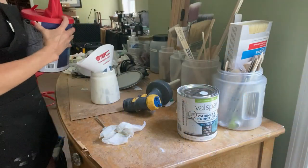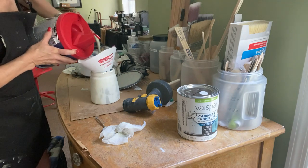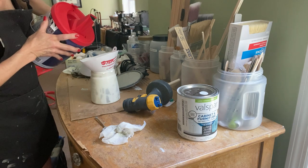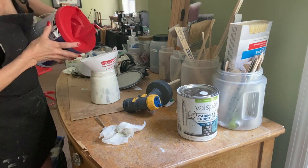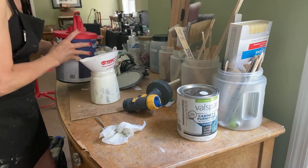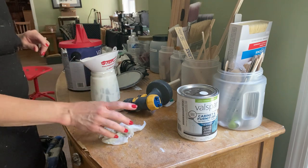Know what color I'm going to be painting these two side tables. I know it's not going to be a light color, but I am going to prime it primarily because I sanded down to bare wood. Now granted, I spot sprayed them with some clear shellac, but I still think it's a good idea for me to go ahead and prime these.